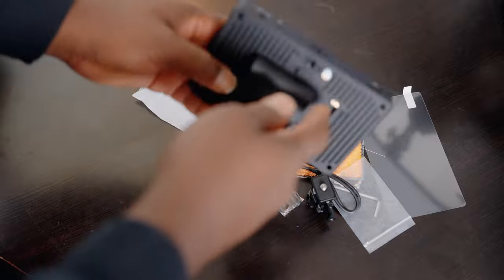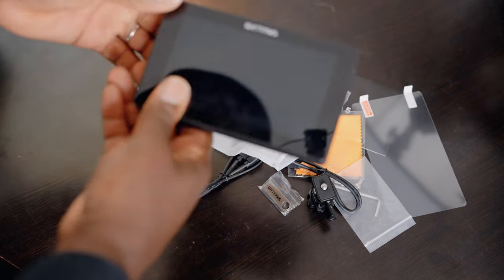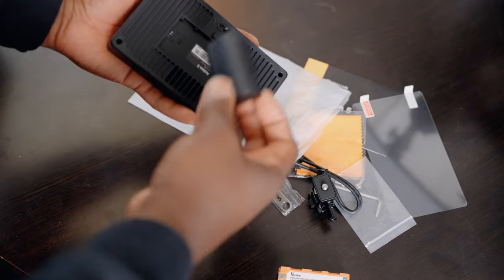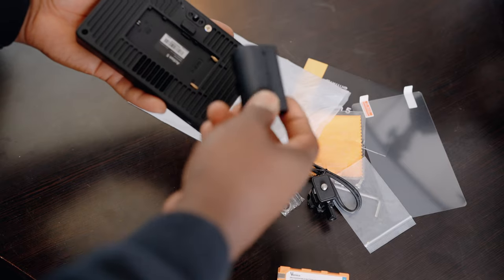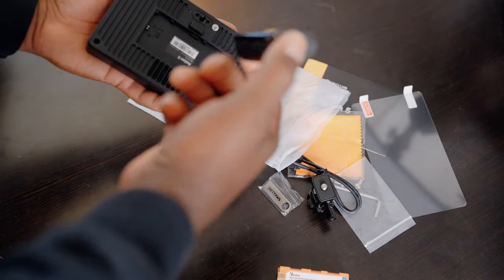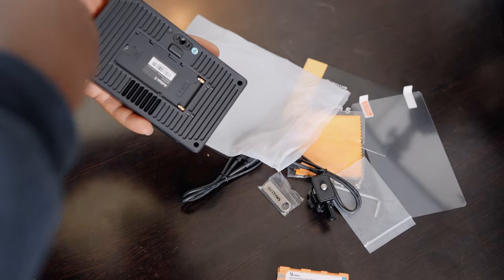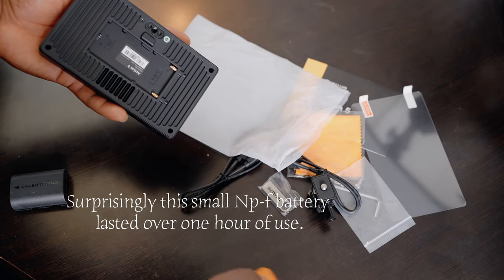This is interesting — on one side there's a Canon LP battery slot, and on the other it can be powered by a Sony NP-F battery. Now I would only use the Canon LP if you're using a dummy battery version, because this is not enough power on its own. For me it's a positive — it's an addition. If you have a dummy battery I'll use it, but other than that it hasn't got much juice. It's a 2,000-nit screen so it will run out fast, but at least you have the option of using the bigger battery blocks.